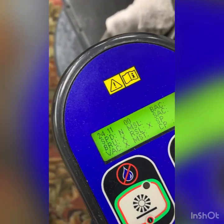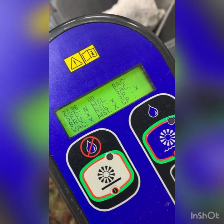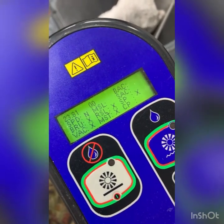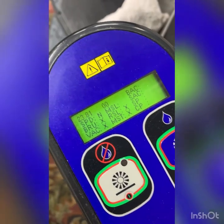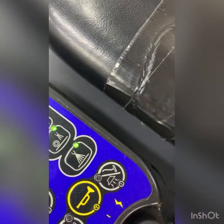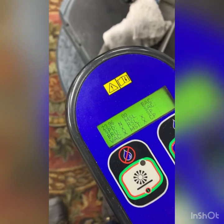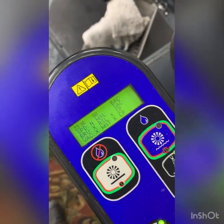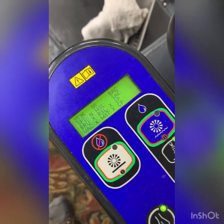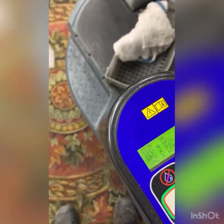See, this is very low. We haven't even been. So this is under 24 volts. We're losing our RPMs already. We shouldn't even be here at this. These batteries have been charged up, and they should still be in the high 24 volts. So right now we're under 24 volts.